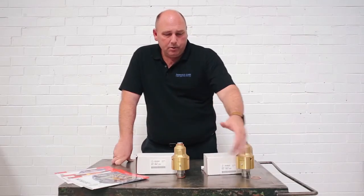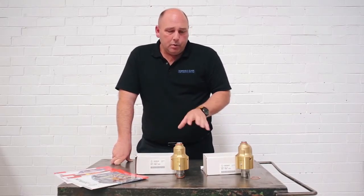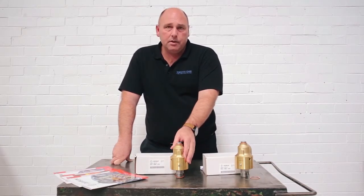It is much more beneficial not to have a grease nipple in the 57, because a lot of unions are over-greased. I just wanted to go through the differences between the two series, because a lot of the time we upsell to the 57 Series, which is a better union to use with water.